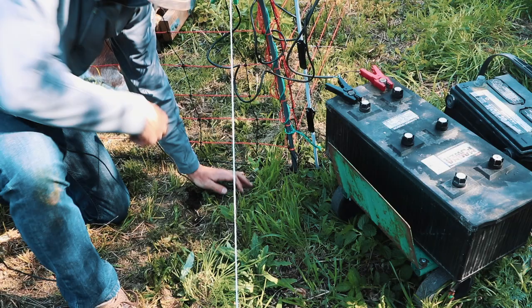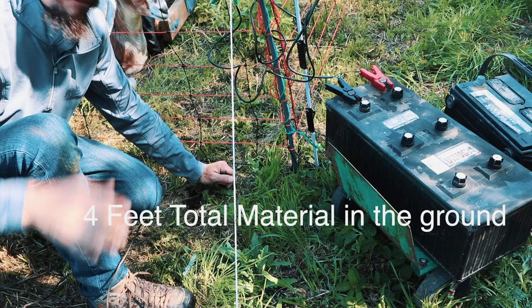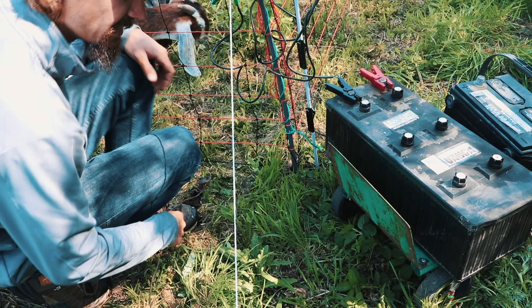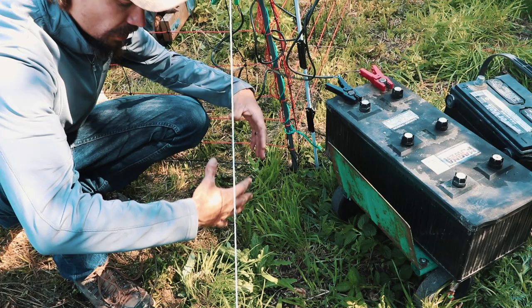That's working well for me right now. The ground rod is about two feet, and then I have about two feet of bare copper wire in the ground — so I'm looking at about four feet of material in the ground to make a really good grounded system for my fencer. We're here in South Dakota, and eventually our ground is going to start to dry up and I won't have that great moisture. So I'm going to need more actual material in the ground to make that good ground connection.